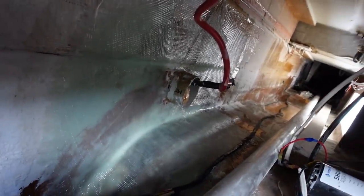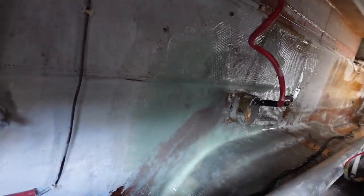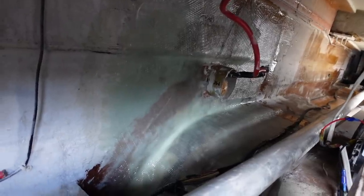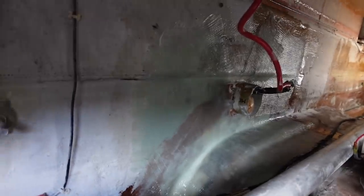From back there all the way down — three layers of biax, there were only two there originally — and epoxy. One thing I'm kicking myself about: we forgot to cut a piece of peel ply, which would have made it blend into the wall so much nicer. By the time I remembered, we'd already started glassing it, so unfortunately it doesn't look as nice as I'd have liked. But it still looks super good and the strength is here, which is the main thing.